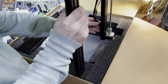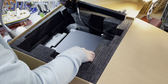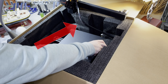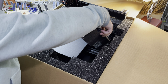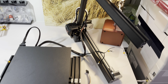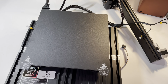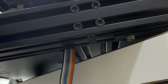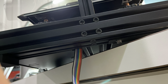I'm not going to show every step of putting the printer together — for the full build I recommend the official instruction video from Creality. One tip from my experience: watch where the main thick wire is going before assembling the overhead frame to the printer body. I did it wrong and had the main wire bundle loop around one of the legs on the inside, and had to disassemble and reassemble to reroute it to the outside. Also make sure to tighten the screws on the bottom really well, then tighten them again once all four are in.